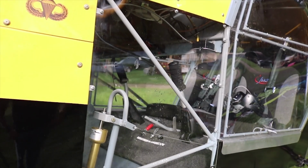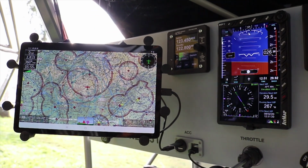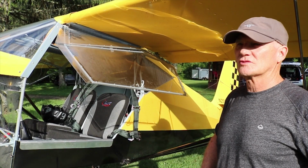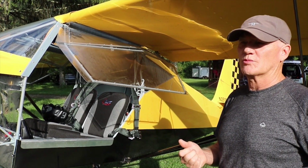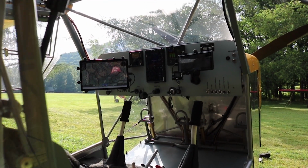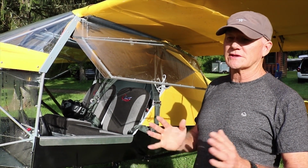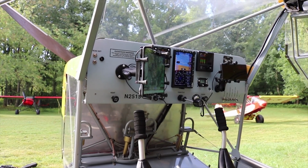So for the avionics, I went with AvMap for the main pilot heads-up display, and I have the accompanying instrument with that, the AvMap NG box, and that's handy because very simply it gives you RPM, coolant temperature, oil pressure, very quickly at a glance. Red, green, yellow, so that works well. MGL Avionics is my radio, and then all my navigation is fed Wi-Fi from an Avionics Echo into my tablet. It's a 10-inch display screen, and so I get ADS-B in for weather and traffic.